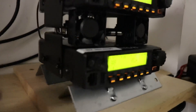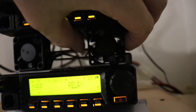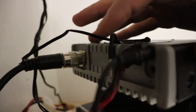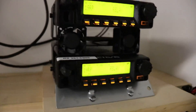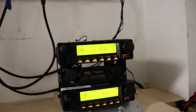I've got these little fans — right now they're just wedged in between. I'm going to do a more permanent setup, but I've kind of angled them so they're blowing into each other. The hottest point is right here on the backside. I've put a little temperature sensor right there, and that is giving me my reading from up here. So as this thing gets up to 90 degrees, those fans automatically cut on, and it cools the repeater. It works pretty good.